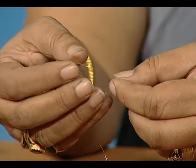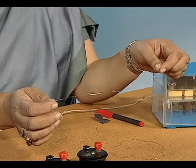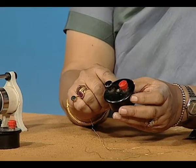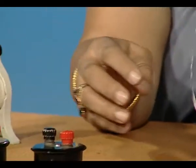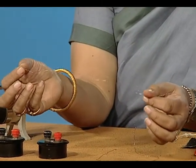If you have to use a wire of a particular resistance value — say for example you want 2 ohms — all you have to do is choose a wire for which the SWG is known. That means the resistance per centimeter is known, and you take the length accordingly and connect it in your circuit. Then you have other resistances which are fixed resistances. For example, this is a 5 ohm resistance with two terminals. It does not mean that because it is red it should be positive, because a resistance does not have a positive or a negative — the current can go in either direction and it would not make any difference to the value of resistance.